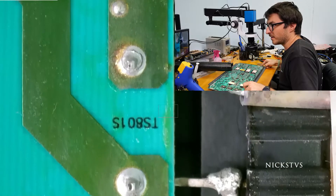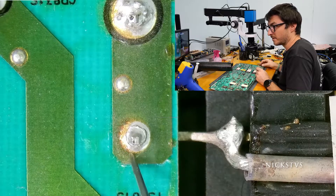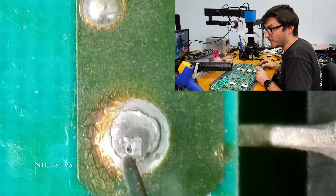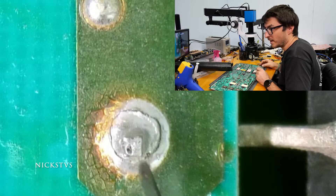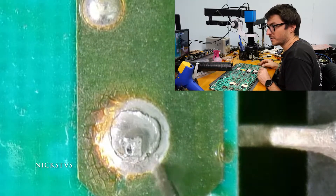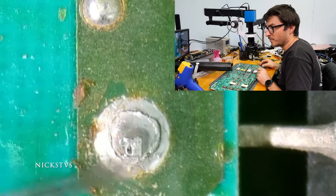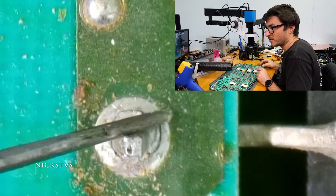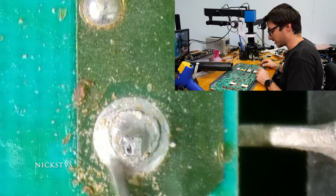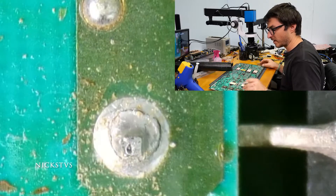Now if we bring this down a little bit — look at this one. This one is probably the immediate cause and the reason that the TV is not turning on. We can very clearly see — if I touch the pin, you can see it move — that pin is completely loose, it's not making any contact whatsoever with the board anymore. You can see that shadow around it and we have burnt flux here on the edges. This is definitely the immediate cause of why the customer is not getting power right now — there's just no flow of electricity, it's not making contact.